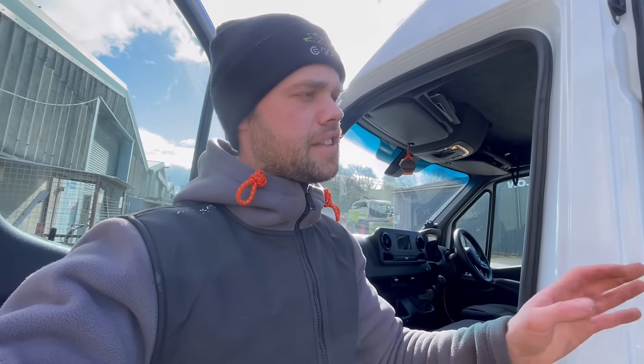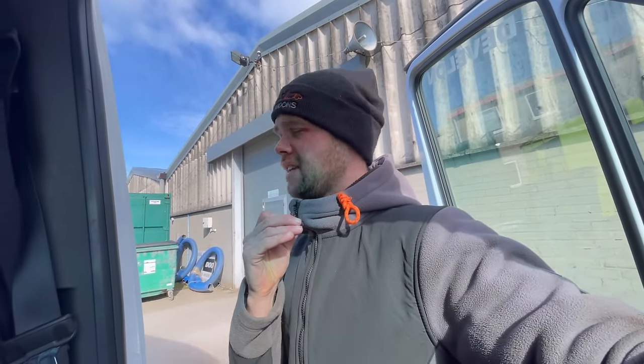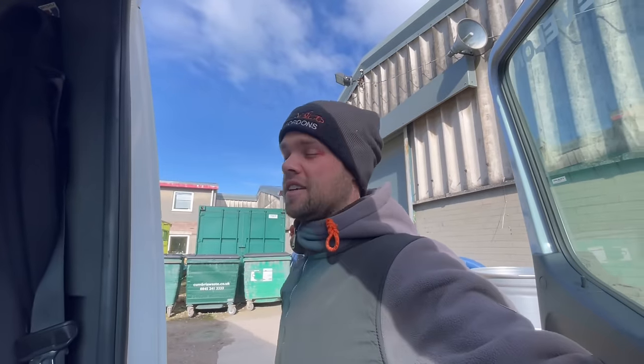Different tactic today — I've got a mag drill, and if they put up any sort of a fight I'm just going to mag drill them out and re-tap them. Spending four hours on one bolt is just demoralizing. Sun is shining, so all the more reason to get it done today.